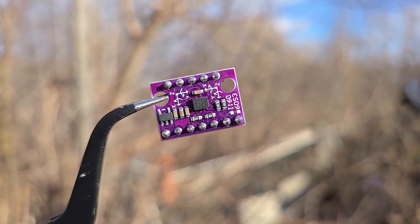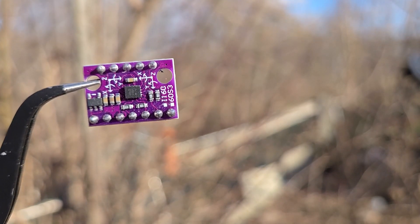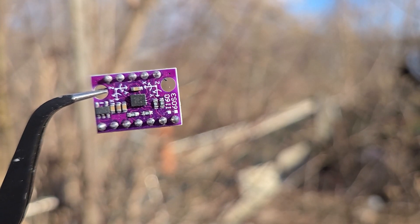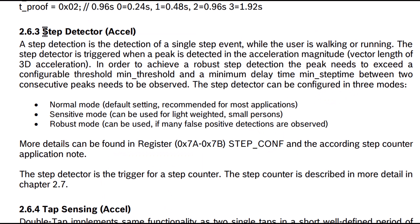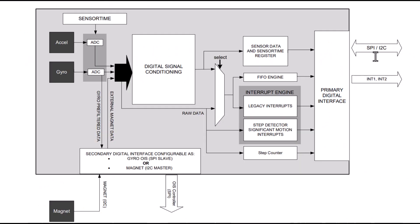This is the main component of this project, which is the BMI160 module. The BMI160 integrates a digital signal processing block specifically for step counting. This hardware module continuously filters and analyzes the acceleration data to detect step-like movements. When a step is detected, the BMI160 automatically increments an internal step counter. This counter is stored in dedicated registers. Because this step counting is handled internally, designers can quickly implement a pedometer by simply reading this step count register.